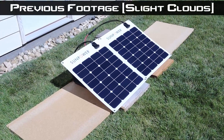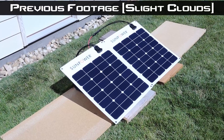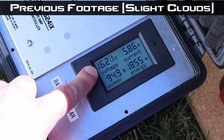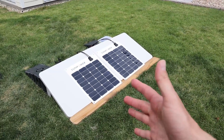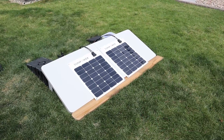We're going to test my SunPower Flex 50s in parallel. These usually produce right around 49 to 50 watts in perfect conditions. We're seeing about 94 to 95 watts input on these SunPower cells — right around 16.2 volts at 5.8 amps. Because these are two panels in parallel, if you partially shade one you're going to see around 50% of the output, so no issues with partial shading.